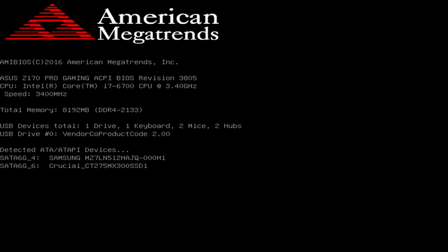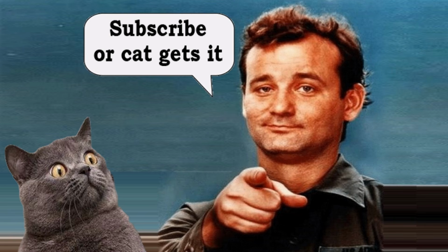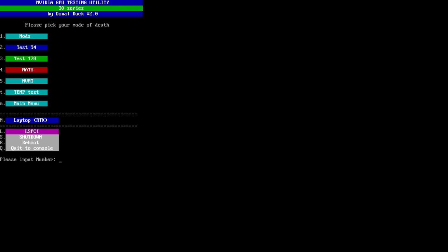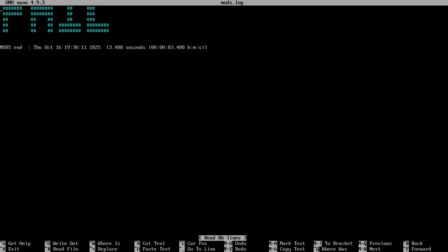It's most likely liquid metal that creeped itself in while somebody was trying to clean this thing up. So if you got liquid metal on your GPU, cleaning it up is a very challenging process. You must not allow it to creep anywhere under no circumstances. And if you see it starting to creep somewhere, take out the vacuum and just suck that thing out. I mean, there's no safer way. Seriously, suck it out with a vacuum.